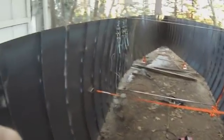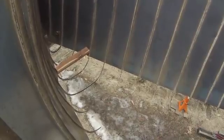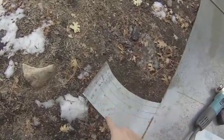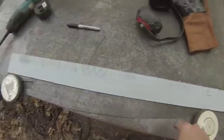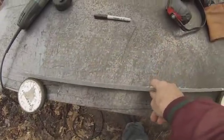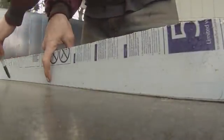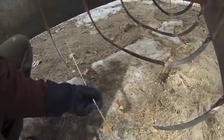Here's the inside of the boat — this is the end of day 12. I'm now cutting pieces for the bottom to connect one side to the other. I'm eyeballing it for now. I've decided that about 25mm of drop for every 400mm of horizontal movement looks good. I put a couple of speaker magnets a certain distance apart and measure — this one is about 600mm, whatever that next rib happened to be — then I pull the piece in to make a nice curve and trace along the edge.